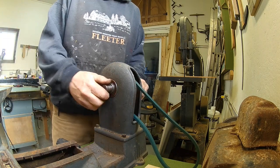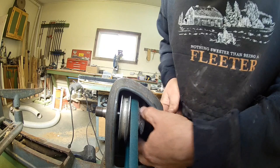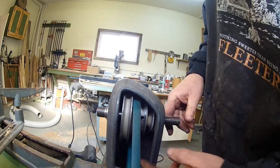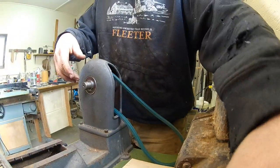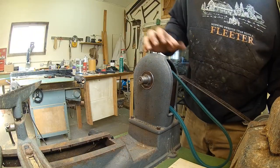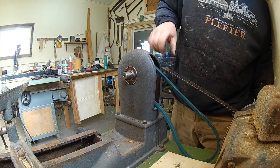I'm satisfied there's no end-to-end play on it. The pulley can walk back and forth, so we have to put the set screw back in. You don't want it interfering with the housing on either side. An easy way I found: just grab a square, lay it across the pulley to draw a nice straight reference line. That tells me where the edge of the pulley should be so I can look down on it and line it up in a happy centered spot.